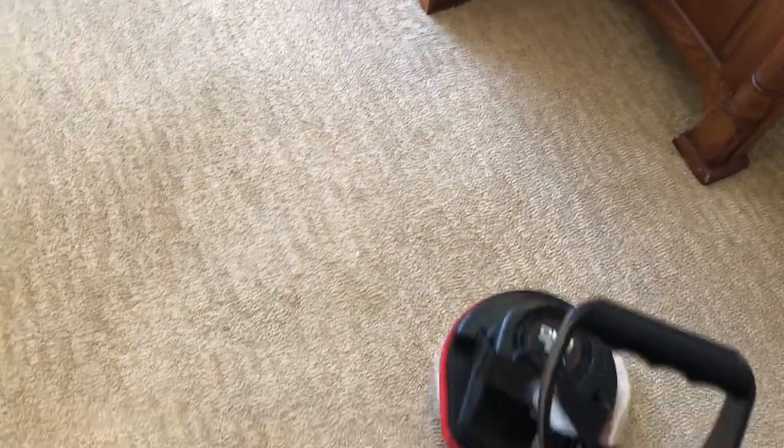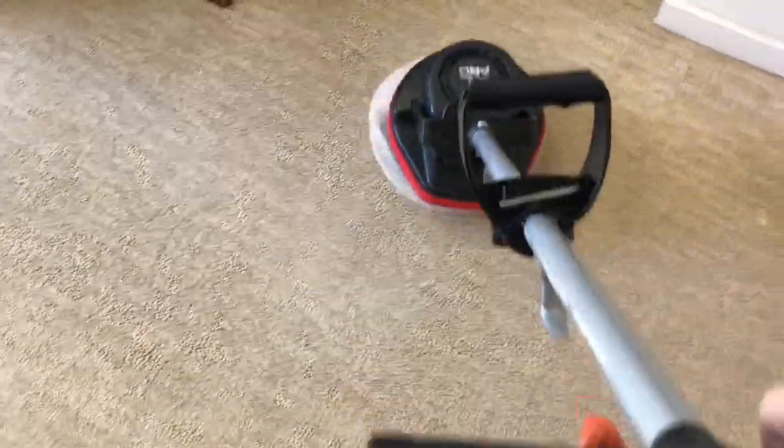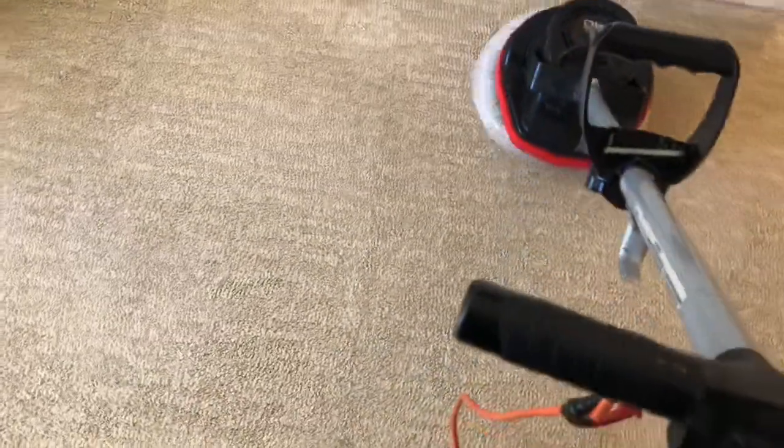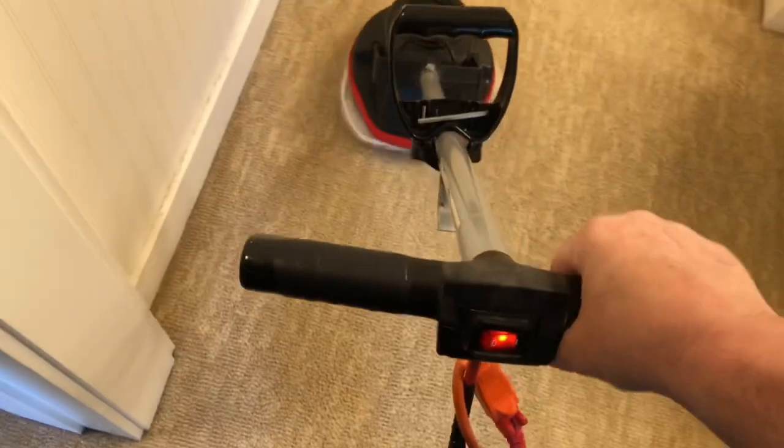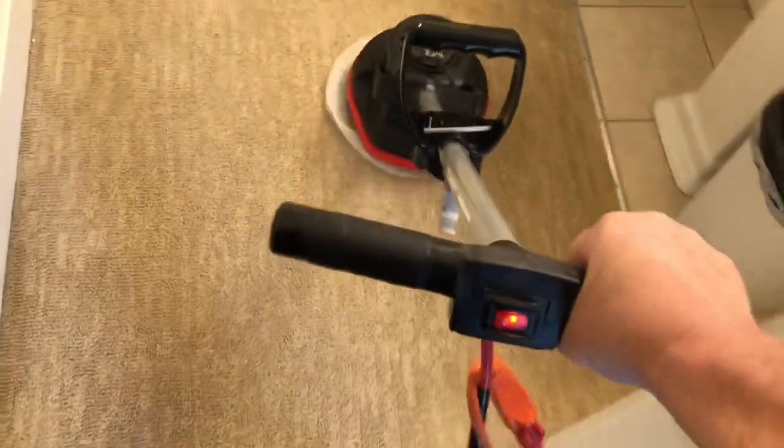So if you're at a 12 and you add acetic acid, white distilled vinegar, which is probably a 2 or 3 on the acid side, it will bring the alkaline down and get it more balanced into around the 7 range. And if you leave it at that range, you won't have any browning or any wicking back problems.